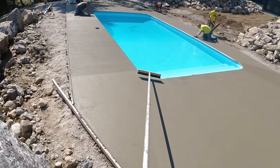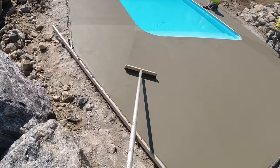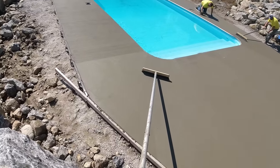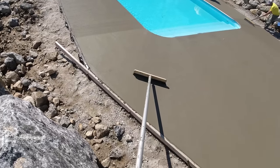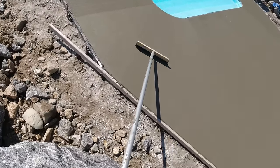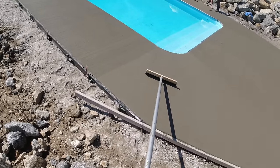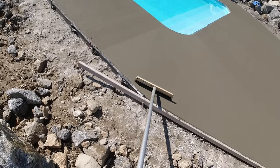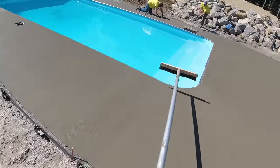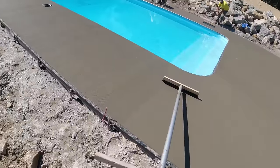This corner I'm fighting the rocks pulling that broom back. I actually had to climb up on them because of the width of the pool deck — I needed about 12 feet of handle length. When I run the broom I like keeping it at a certain angle when I pull it backwards. I don't like changing the angle too much, so you get a more consistent broom look at the same angle and pull it back at the same speed without stopping and starting.